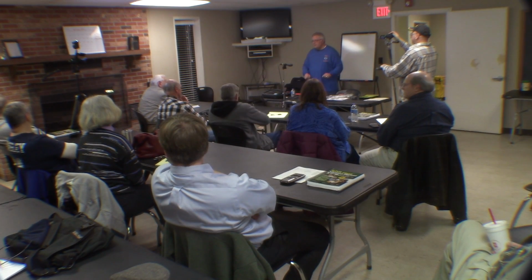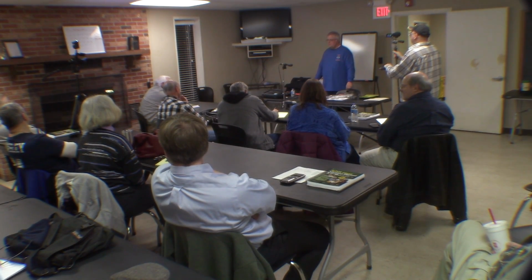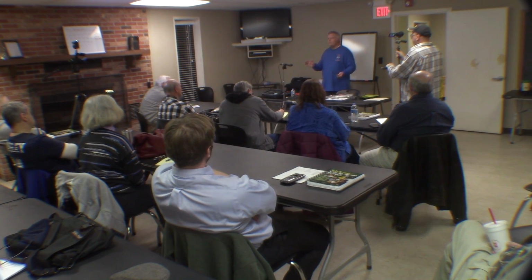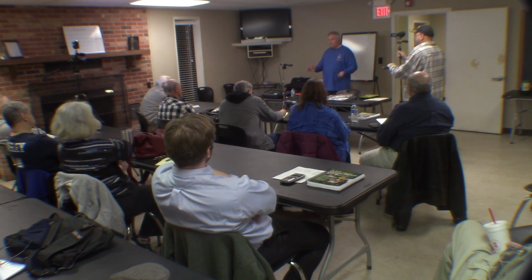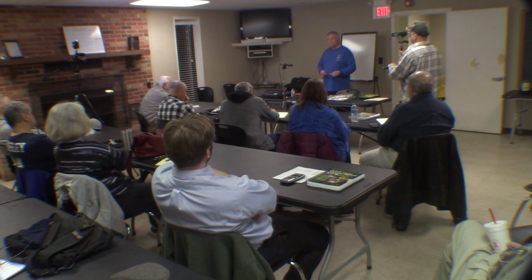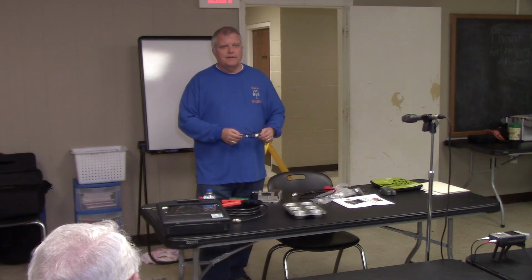Phil asked me if those would handle power well. Oh, absolutely. Yeah, I use them on my legal limit amplifier. RG8X cable is rated for 1,000 watts. So if you're going to do RTTY, where it's 100% duty cycle mode, you need to move up to RG8 or 213 or LM400 or whatever it is. But other than that, yeah, these connectors are primo.